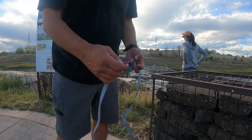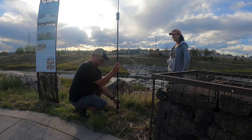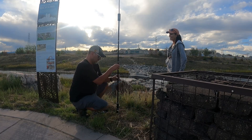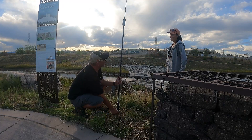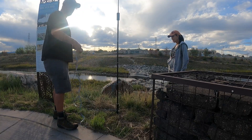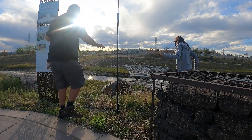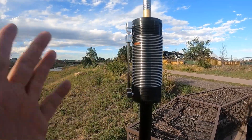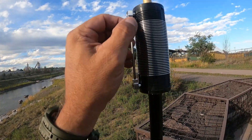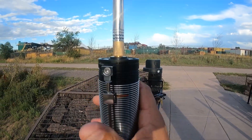This is the counterpoise that comes with it — it's like a ribbon cable. They make it so there's one attachment point, and then you can open up and separate the ribbons, which is probably what I'm going to do. I'll have my lovely assistant hold the antenna. Actually in ham radio world you'd be my YL — Yankee Lima. Alright, counterpoise is on, easy peasy. Stretch this out. We'll make about three contacts for this video. You can see it has a couple red marks for 20 meters and 40 meters, so we're gonna put it on 20 meters and see if it tunes up.